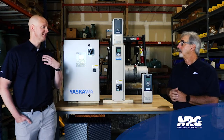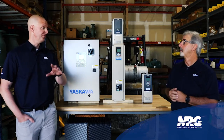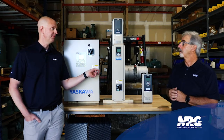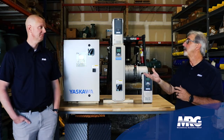Are you going to mount your drive in an exterior location? If you have a cooling tower application or an exterior pump application, that's going to dictate the kind of cabinet you put it in and the type of drive you're selecting. Length of lead means a lot too — most of the time we say 167 feet is the limit from the drive output to the motor.